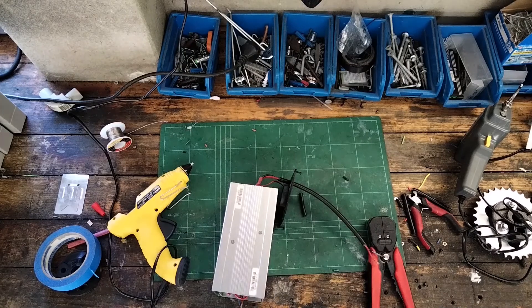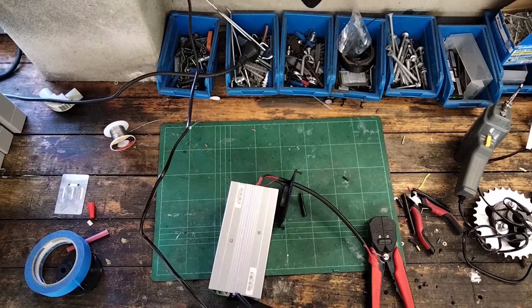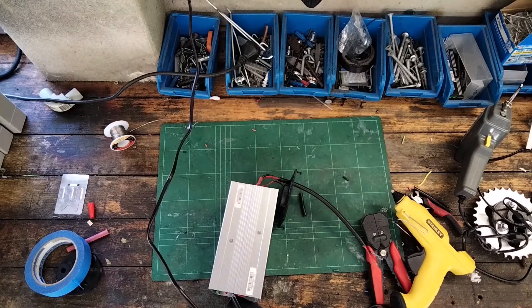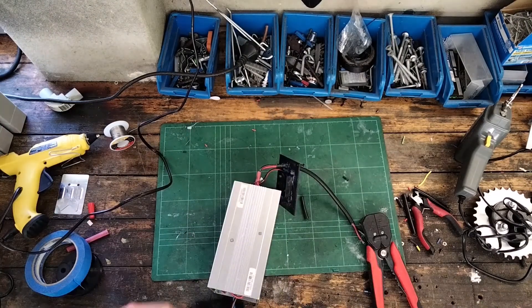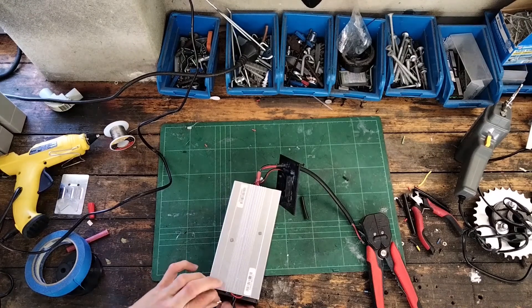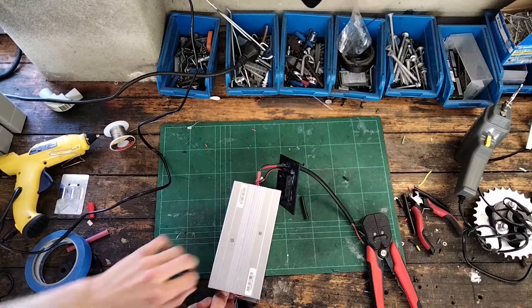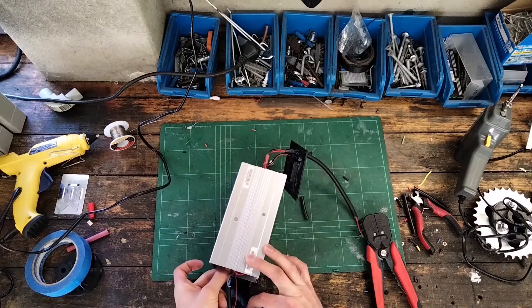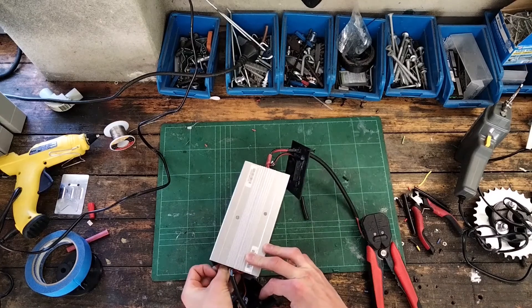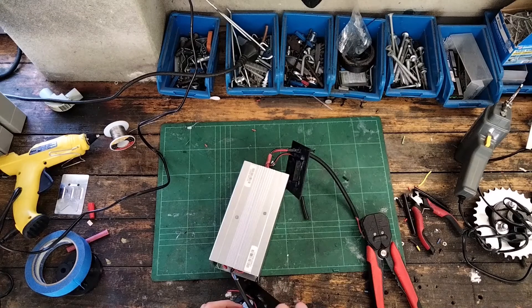We're going to put it back together now. We can use a little bit of hot glue around the connection point — that provides support so the cable is less likely to pull straight out if it gets impacted. Let that set, then do it on the DC side as well. Don't forget to plug in the fans because they are of utmost importance — this unit is being run at slightly over its rated capacity, so there will be more heat, especially in the inductor, the transformer, and the power devices mounted on the heat sink.